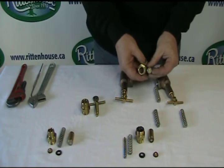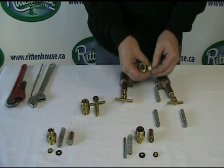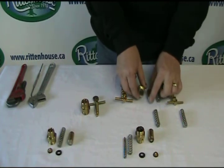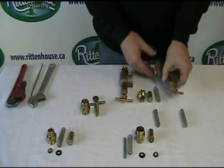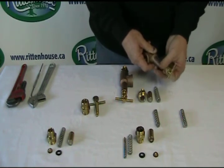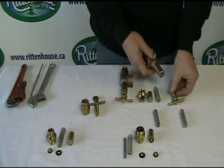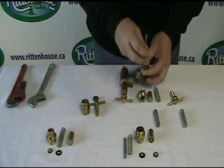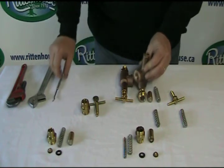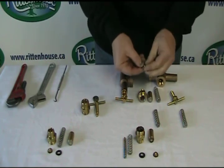Generally the seats will last a fair length of time because they are stainless steel, but due to wear, chemicals, and powders running past them, they will wear out. Once we've got this apart, there is one other part inside that we need to take out — that's the upper seal, which is on a brass plate that also helps push the spring down evenly. Take something and push it out through the top, and there's the brass seat with the rubber seal on it.